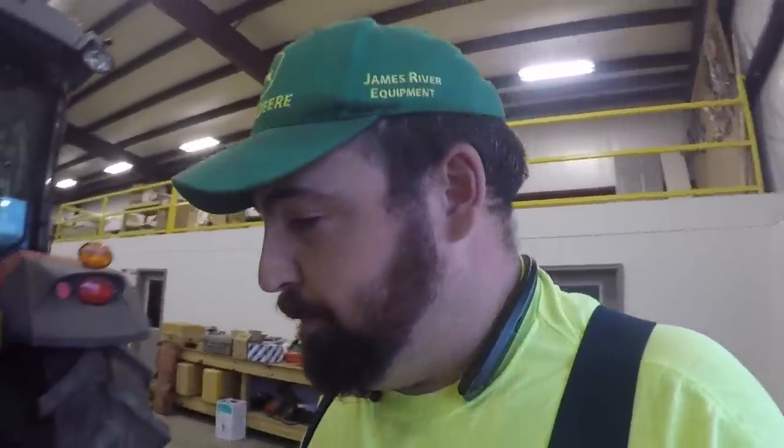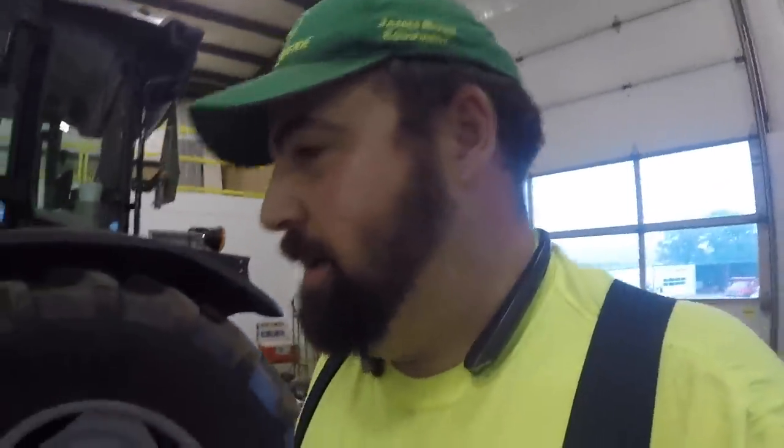I had the tractor running. I had the AC compressor running. I pulled that thing up a couple inches, and I just sat there and waited, and the AC compressor shut off. A few seconds later, it came back on, and it shut off again. And that's what it's supposed to do. Before, it was staying on continuously, and it never would shut off and let the evaporator warm up a little bit to keep the ice from forming on it. So, whether you care to know that much information or not, there it is.